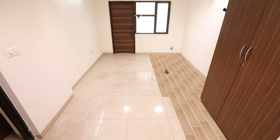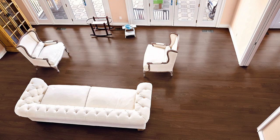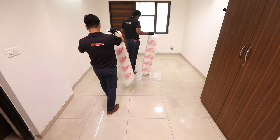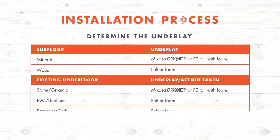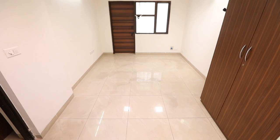Usually while planning installation, we begin installing floors from left to right alongside the length of the room, and in narrow corridors lengthwise along the walls. If there is an existing wooden or laminate floor, install in cross direction, or use a ply as underlay if needed in the same direction. It is essential to install a moisture barrier underlay when installing Mikasa floors on concrete, sand, or cemented base. We recommend using only Mikasa WeProtect for underlay, as it is the perfect combination of PE film and underlay, acting as both a moisture and sound barrier and a suitable intermediate layer.